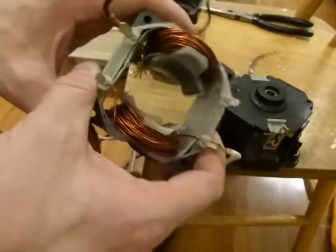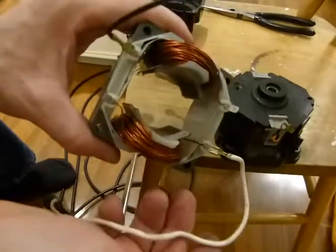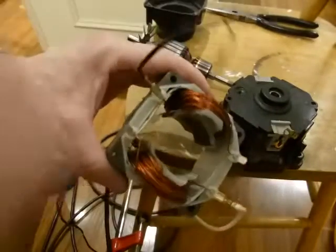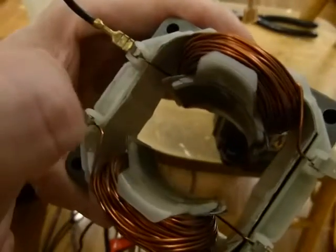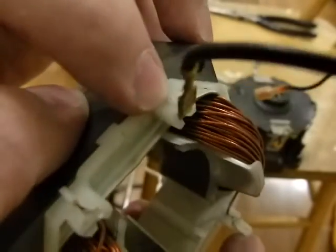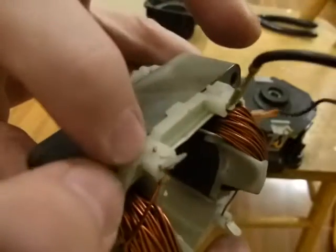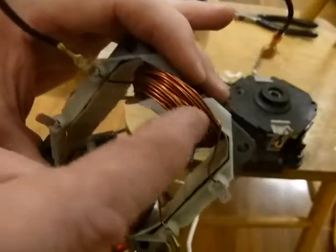Now I've totally got it apart. This is how it was oriented when the measurements were taken. I've added two wires back — so electricity enters through one end, comes through the hot there. The hot is hooked up to this coil. You can see that the end of the coil is terminated with bare wire, and the varnish is scraped off at the end so that these little connectors can have solid contact. So power goes through there and it comes out here — that's where this brush was hooked up.